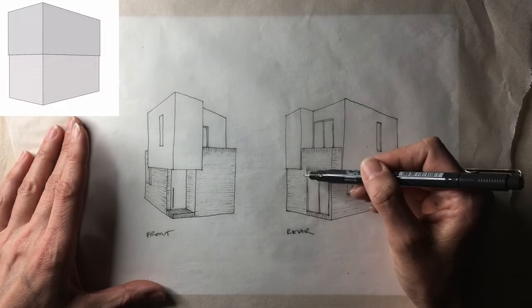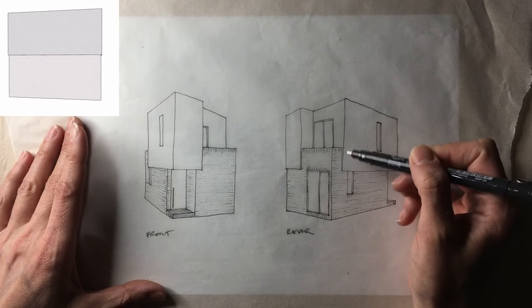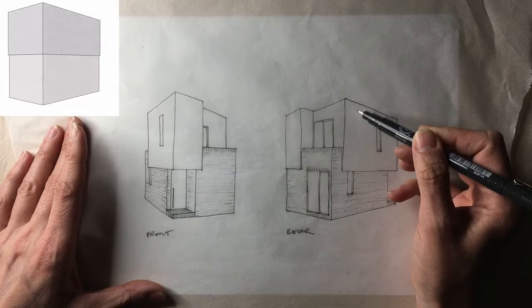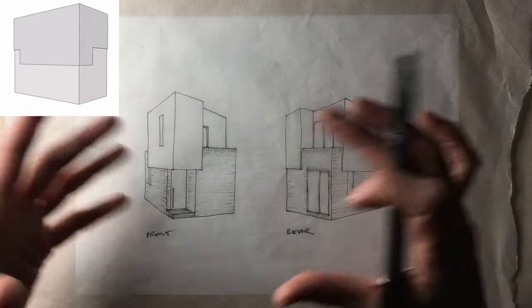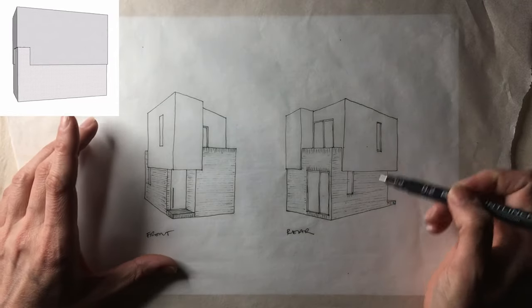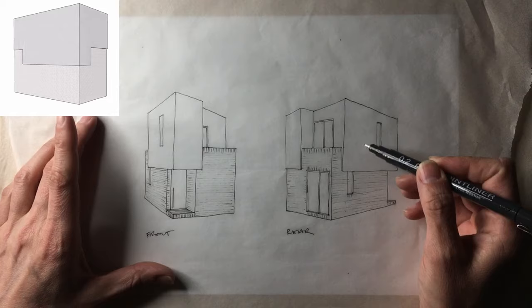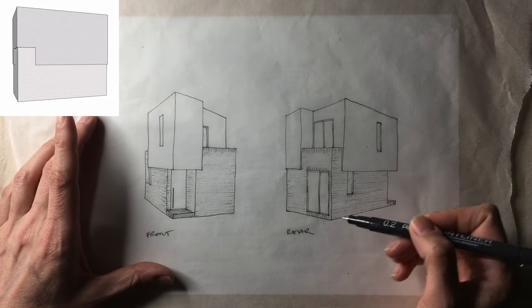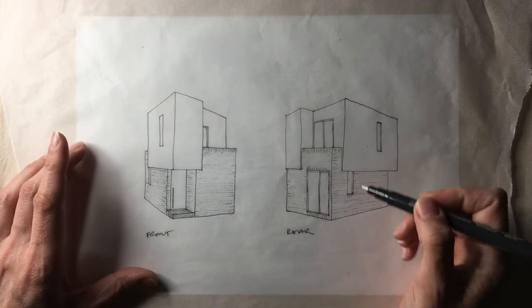Because the render is more flexible in terms of how it can meet the junction with the brick, I've extruded it slightly so it sits proud of the brick and the two elements slot together. That breaks up the dividing line you would get from it being two stories and two materials, and instead brings the whole volume down to avoid that really tall look.